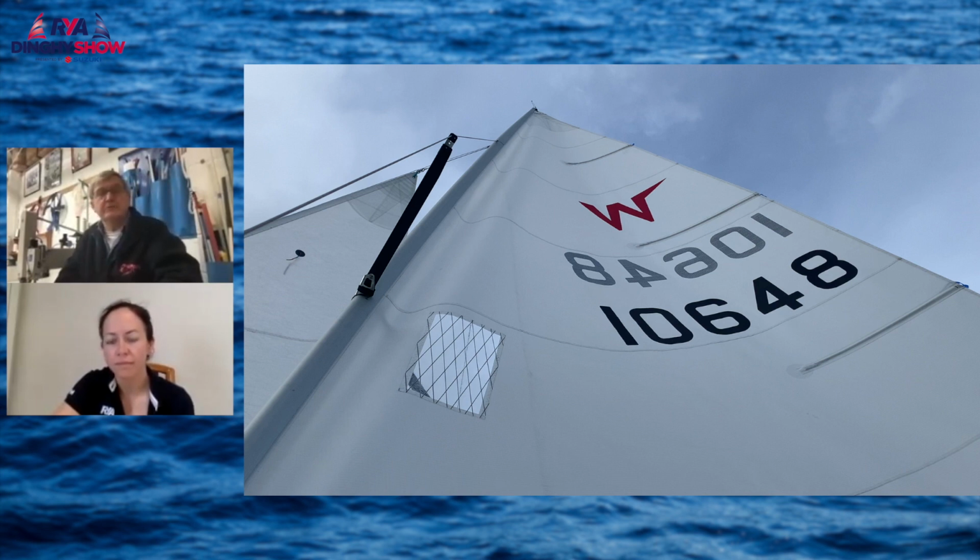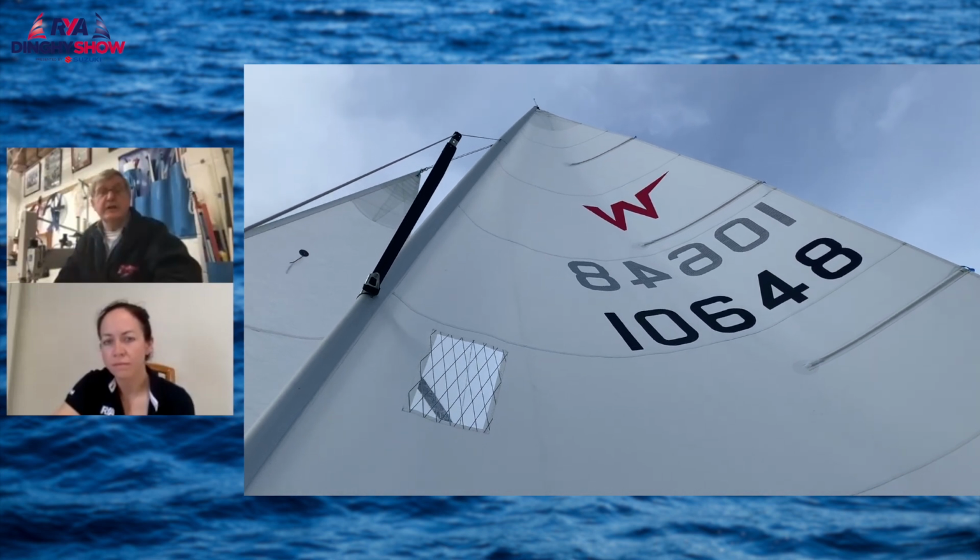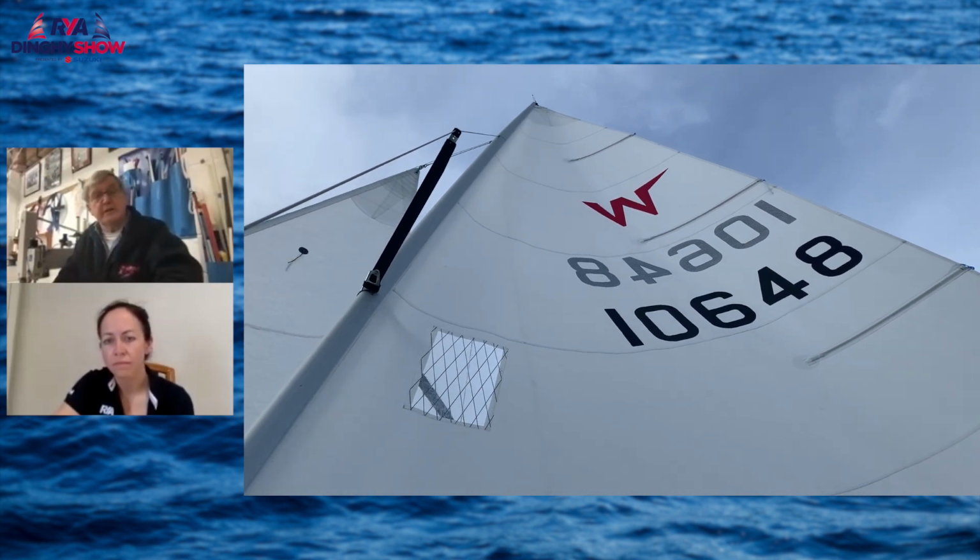If the telltale stalls like they're doing now, then one side of the sail has broken down. The airflow on the leeward side has broken down. The telltale has gone round the leeward side. How do we sort it out? Easy. We just ease the kicker, ease the main sheet, open out the leech, weaken the support for the leech